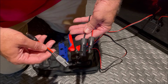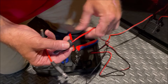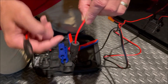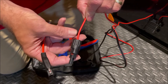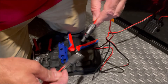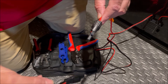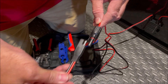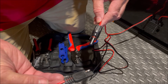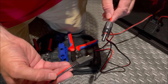In the last video I told you the source hot coming from the panel is always going to be red, and the red source hot is always going to be on the male connector. But in this case we're plugging into the adapter, so the red needs to now be on the female connector. When we cut this, we need to make sure we put the female connector on the red line and the male connector on the black line.